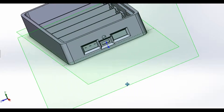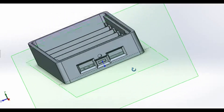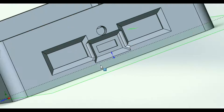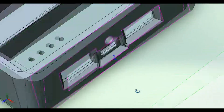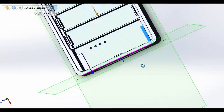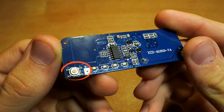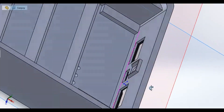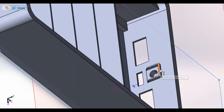Before 3D modeling you should imagine yourself the final product that you are going to make, because there are too many nuances that can be prevented. The USB hole is on the front panel — it is not without purpose there. The location of the button on this module is not correct; it should be on the front panel and of course not on the back side, because the power bank will always be turned on.